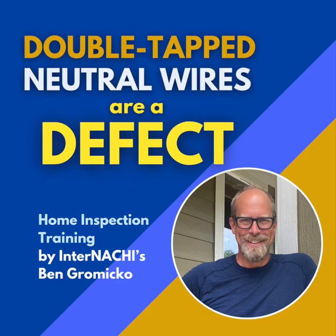You could get, say, 100 volts on one circuit and 140 volts on the other instead of the normal 120. It's called an over-voltage condition. Imagine your TV or computer suddenly getting hit with way too much voltage — fried electronics instantly. It can destroy sensitive appliances and electronics. And that unstable voltage and potential arcing raises the fire risk too. It's a critical failure point for MWBCs.